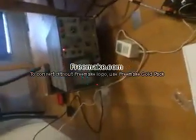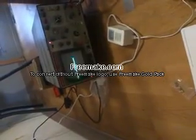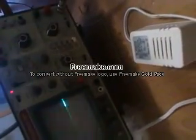As you see there, the middle one has the same effect as the other one. Another thing I wanted to show you is that when you're measuring these signals on your oscilloscope, you want to measure at 1 volt per division or less, depending on how well it looks on the screen. I had it on 0.5, I think, or 0.2. You don't want it to go over 1 volt when you measure on the oscilloscope. If it goes over 1 volt, it's not working right.